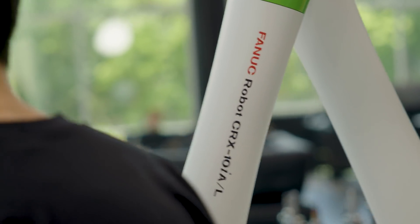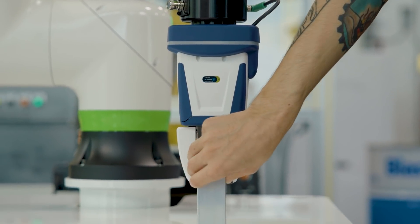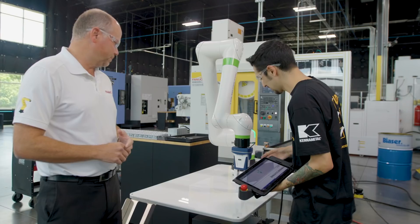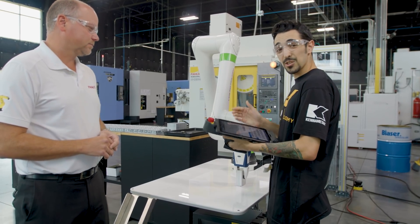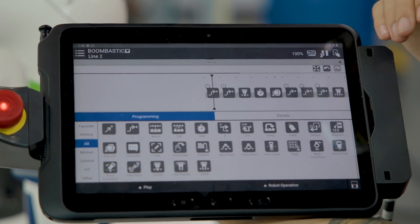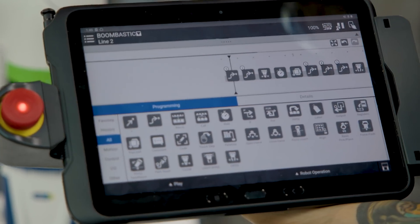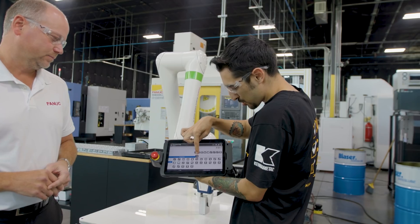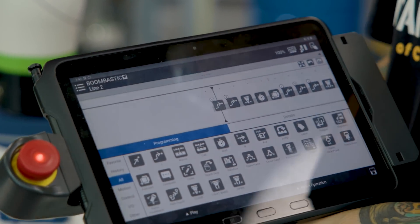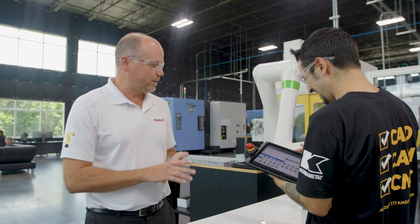In reality, systems are always upgradable — you could have vision on this robot so it'll always know where the parts are. But for our purposes I just want to show you guys how easy it is to do a pick and place. That's what we're doing, right Matt? Just a pick and place. The other cool thing about this robot in particular is how we write our programs. This isn't your standardized industry way to program on a robot controller — this is really friendly. Everything is labeled in these boxes. It's almost like block coding where all you do is drag and place, and that's how you program all day long. It's friendly for people who don't have to go through menus — no need scrolling through menus or trying to find the right way to get there.